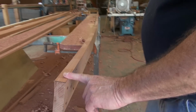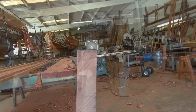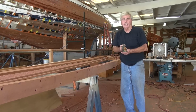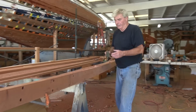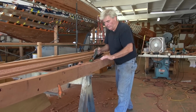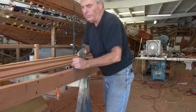Now you look here, we're almost square up by the butt. That's because it's approaching the midships area, and this plank at that location is almost plumb. We're close. See now, remember you could hear it skipping? Yeah. And now it's beginning to hit everywhere? Yeah. Nice. You'll hear it skip here. Hear it? See, it skipped? So that's all you're doing. It's just a miniature road grader.